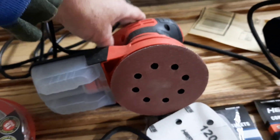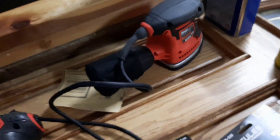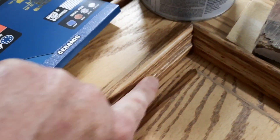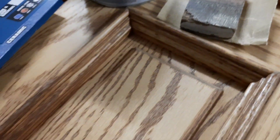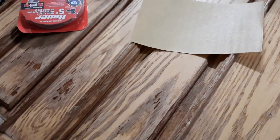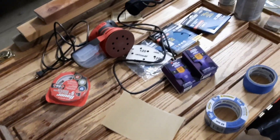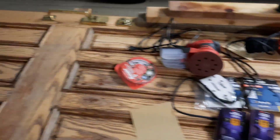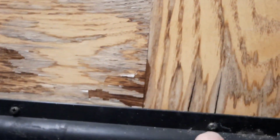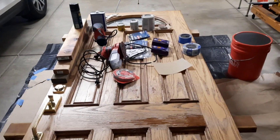We have a crack right here. This molding on the side has lifted up somewhat, so I'm not sure if we're going to put a brad in that or if we'll be able to return it to its original position. Going further down the door, as the angle of the sun hits it in the summertime, you can see here the old polyurethane finish has really come off and has exposed some of the wood. Here in the middle band it's much worse.